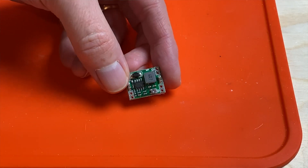So I thought it'd be a good idea to see what happens when you use a 7812 instead of a buck converter. For about 12 bucks, I got a dozen heatsinks and 15 7812s. I also grabbed a couple of buck converters from the earlier video — this arguably huge one and a postage stamp sized one. The smaller one is what actually made it into that video. I've soldered some wires on the buck converters so I can plug them into a breadboard, and I want to run all these devices at the same time and measure how much heat they create.